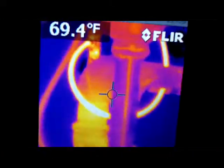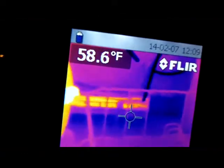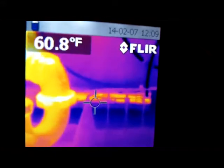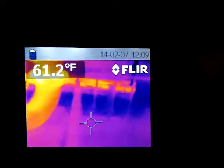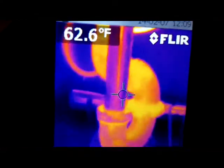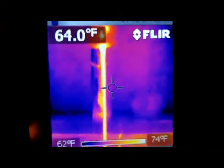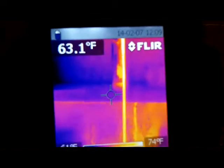There's the cold water line running through a filter. The filter looks hot — that's reflection of the metal. Sometimes it reflects a hot color, but as you can see, no leaks. There are no blue droplets on the floor. If it was hot water there would be red droplets on the floor. You can even check electrical lines — if a BX cable or Romex cable was warming up on me, it would show up red hot. BX reflects yellow but would be a red or white color if overheating.